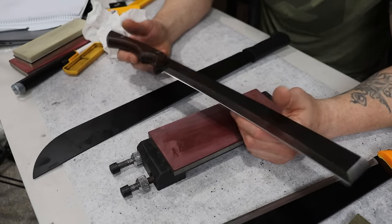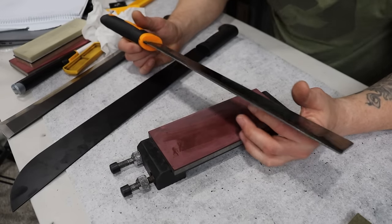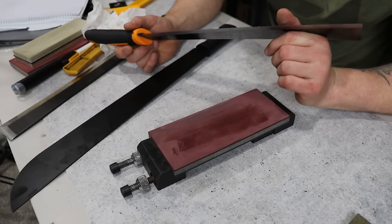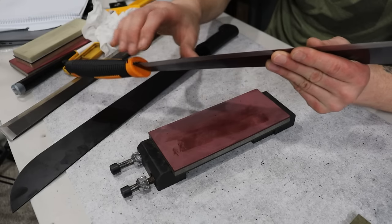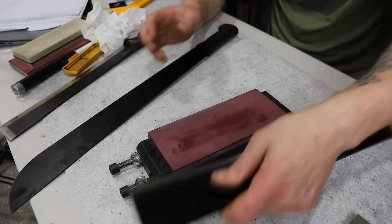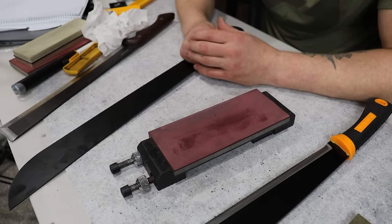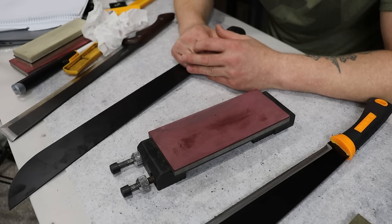So this one — the $60–$70 — is decent; I'm not even going to complain about that one. Then this $30 one — most likely the heat treatment is shot. Let's say it's just the burnt edge: it could probably be tuned up a bit. I was able to get it sharp back where the burr has gone. But there are a lot of spots where you can feel micro tear-out — you can feel that when the burr came off, it took steel with it or left steel behind. I tried getting rid of it, but it'll just have to come off with some chopping.